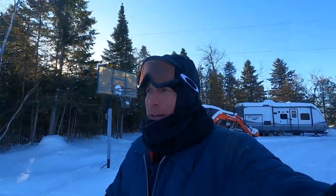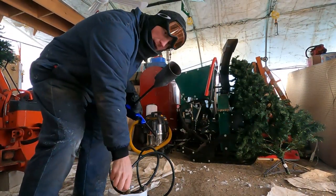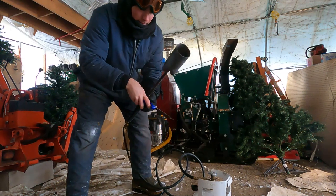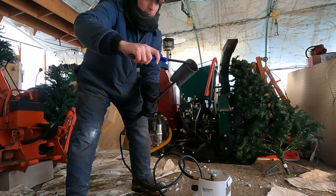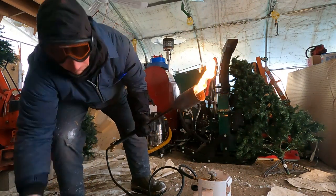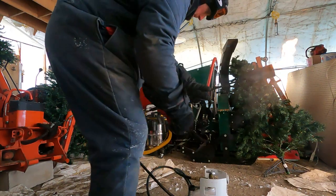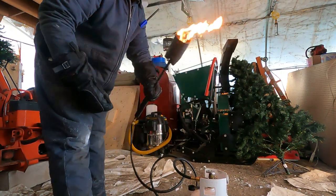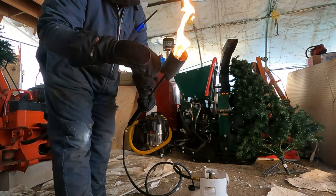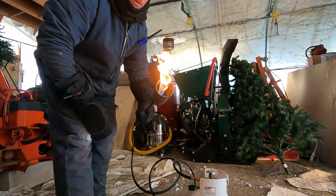It's so cold, this is not gonna be fun. Even the valve on the propane tank is fighting me. Of course, there's a problem with this too — this is all the flame I can get out of it. I think the drilled orifice on the inside is probably plugged up with some rust or something. So another job.